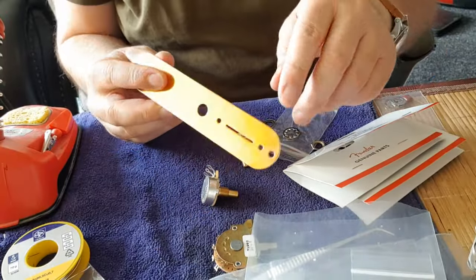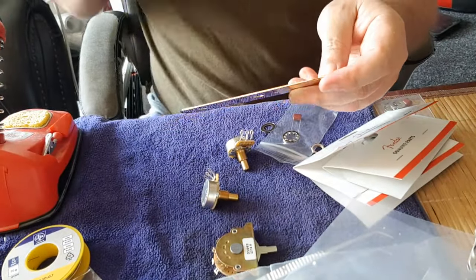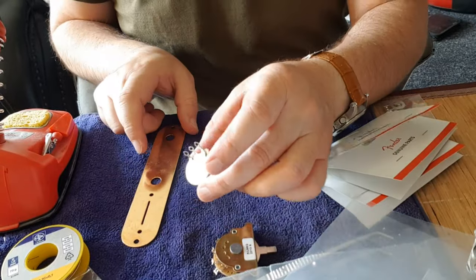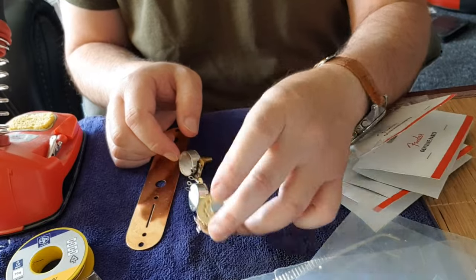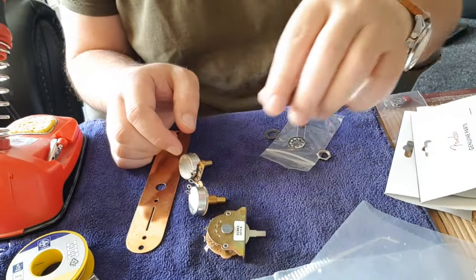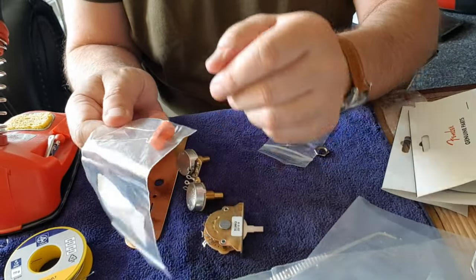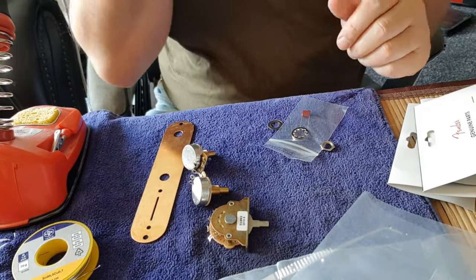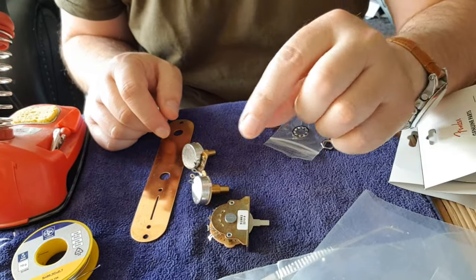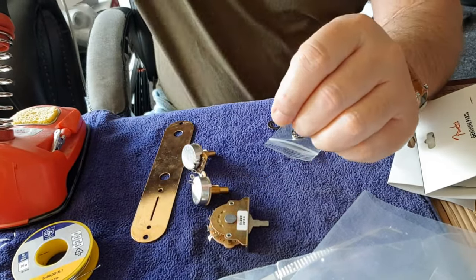So our next job is the wiring. I make it with the Fender Telecaster wiring diagram that I can download from the internet, with the 500k potentiometers, two pots, a three-way switch, everything from Fender, and a ceramic capacitor. This is the first step. If the sound is good, I make it with the ceramic. If not, I change to the oil paper capacitor.